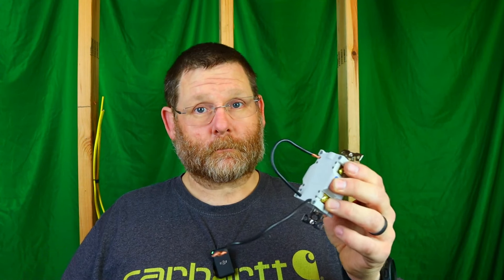You can make a pigtail on these — put a hot here and then put a hot here — so you'll have basically two separate hots, but it'd be the same hot in the box. Or you can put this into the load side and put your hot into the line side. When you turn the switch on and off, it works perfectly. When you hit the reset button for the GFI, or if it trips out, it'll turn your light off. Some people really want that for their bathrooms. If you have a light over the shower and you want to make sure it's GFI protected, you can use it for that. You can also use it for your exhaust fan. I'm going to show you how to wire this and talk about the protection of it.